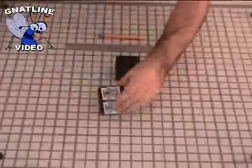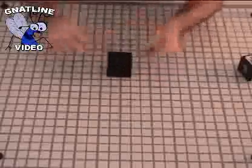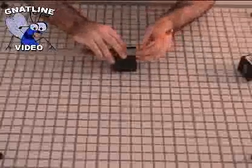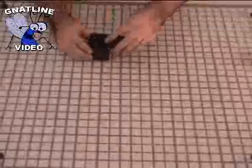So we'll put the cut piece off to the side, and grab that longer piece. Next, transfer the remaining 1/4 inch all the way around, and get a nice straight line so we can cut that. Alright, and we are just about set. One more line. 2 more, there we go. Okay, and grab your miter box and cut that again. Now we have 2 pieces.